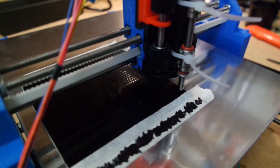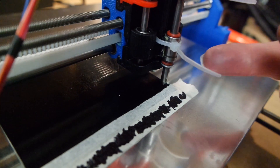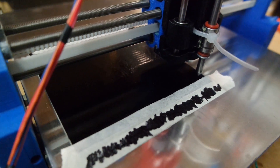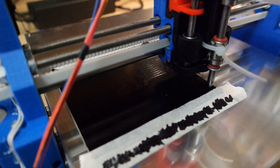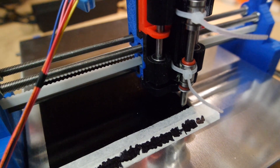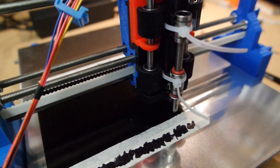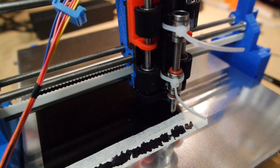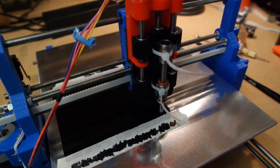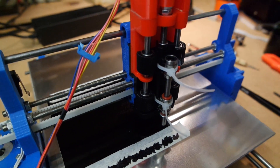Right now I've got a tool mounted in here. This is a type of chisel with a pointed head and I intend to use it to scratch away some of the paint that I put onto this PCB board to see if this can be used for outline milling. I've made some tries and it looks good, but I wasn't able to get anything done that was good enough to actually etch. I'm still trying to figure out if I need to add any backlash values or other optimizations, or maybe if my z-axis just isn't stable enough.